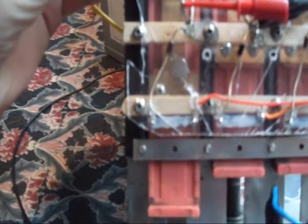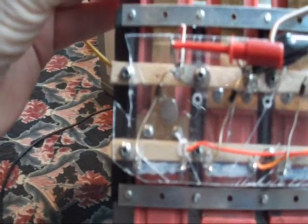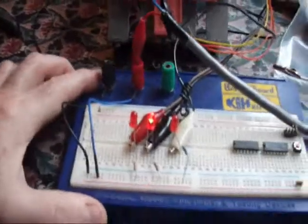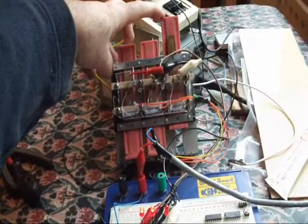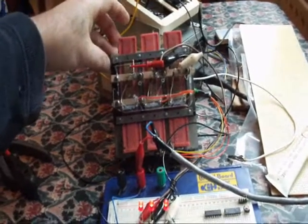You can see the magnet going by there — it's just glued to the back of the target, and I've done that for all three targets. There's the magnet for the second target and there's the magnet for the third. The reed switches are the blue colored switches at the back. When the magnet gets close to the reed switch, it closes and lights one of the LEDs. So if I drop the targets — that's the first, second, and third — you see the three LED lights.